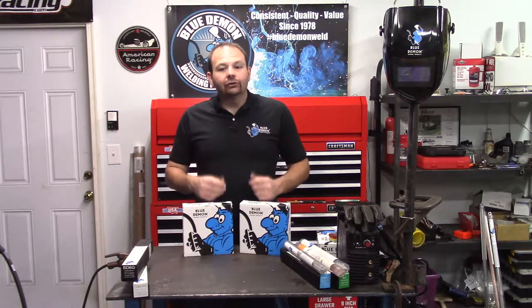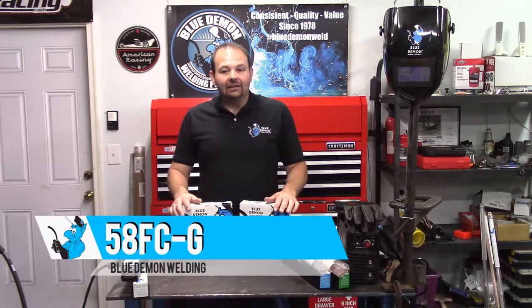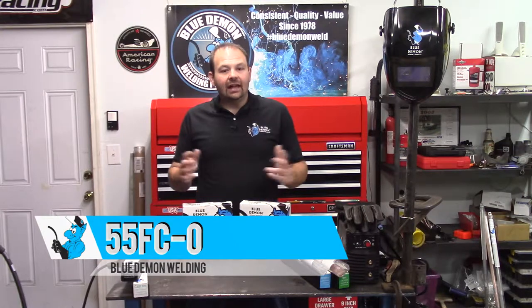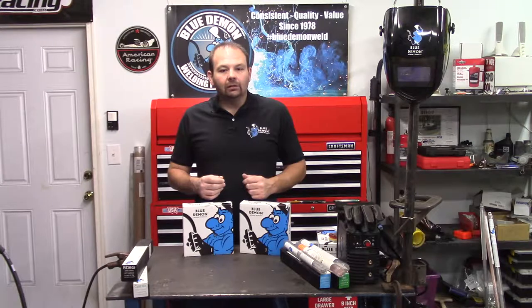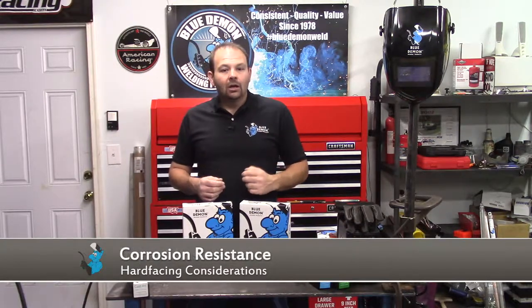Blue Demon offers several hard facing filler metals. Today, we're going to cover 58 FC-G and 55 FC-O. When selecting a hard-facing filler metal, there are a few things to consider. They are hardness, abrasion resistance, impact resistance, and corrosion resistance.